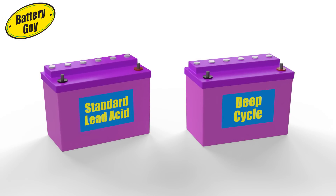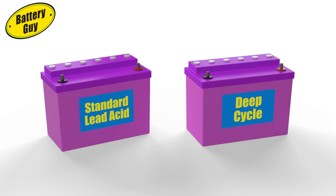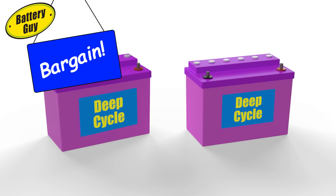This is why deep cycle lead-acid batteries always cost more than their standard lead-acid counterparts. When a retailer shows you a higher price, you know what to ask: what type of plates are used — thickened grid or tubular? Is it flooded lead-acid, AGM, or gel technology? These questions are important because the lead-acid market is poorly regulated, and some distributors actually label standard lead-acid batteries as deep cycle and claim they have the best price. You won't notice the difference for a while, because all lead-acid batteries can deep cycle — but the mislabeled battery will die much sooner than a real deep cycle unit. To avoid this common con, stick to well-known and established brands, and if the price sounds too good to be true, it probably is.